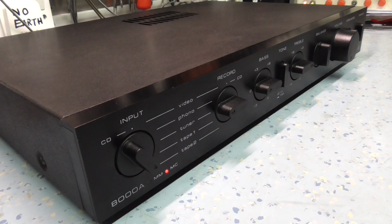It's not an amplifier, as I say, that I recommend you just leave on all day. You turn it off when you've finished with it. You give it ample ventilation. You don't give it to your teenage kids to use as a disco amplifier, because if someone chucks a magazine on the top of it whilst it's playing at full power, it will just go into thermal runaway and burn out. They're not designed for high powered continuous use, from what I can see by the design.